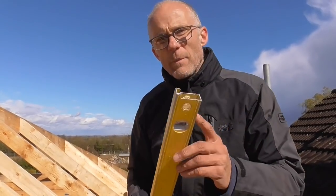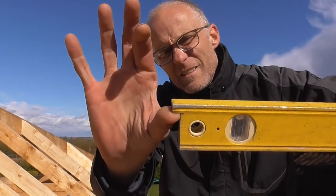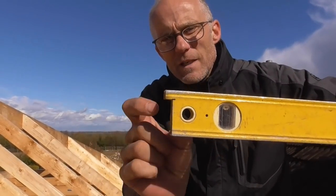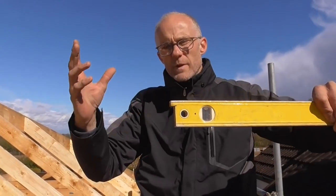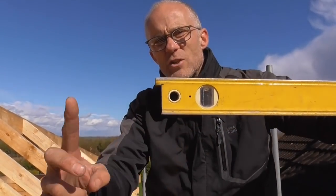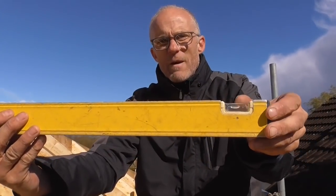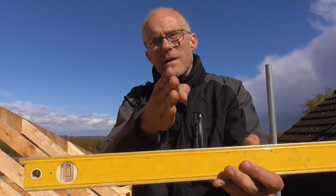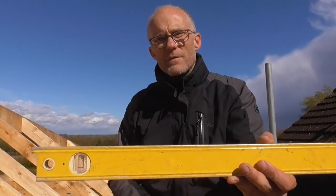So I'm going to show you — hopefully the camera's not going to get blown away, or I'm not going to get blown away — but basically this section here is about 8 or 9mm, so it's exactly the same thickness as most soffits that we use: hollow board or UPVC type plastic soffit fascias. I clip that onto the edge of the external skin — blockwork or brickwork — then I read it out level, and my sub fascia sits on top here. I just pull it up and down until it's level and then nail it into the end of the rafter feet. So hopefully I'm going to quickly show you how I do that.